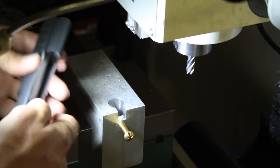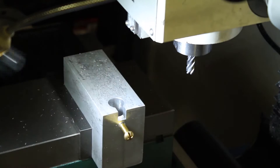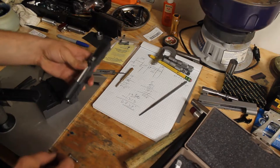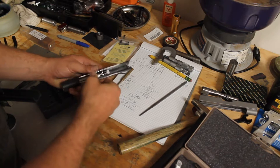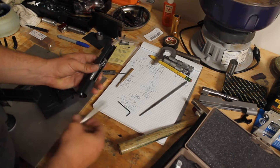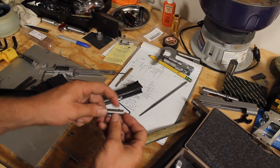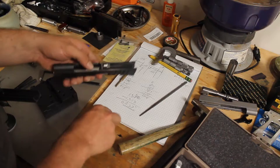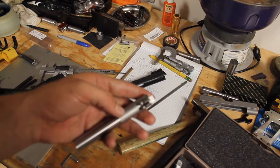We've fitted the barrel hood. The only thing next to get this gun back up and running is to make sure the lower lugs are fit, and we'll get to that next. Back at the bench — now that we're done with the lug cutter, here you can better see the pointed end that's pointing up into the barrel. It does leave a tiny mark on the bottom of the barrel, but it's on the inside and underneath, so don't worry about it. That looks pretty clean — the next thing is to put the link back in and test the fit.